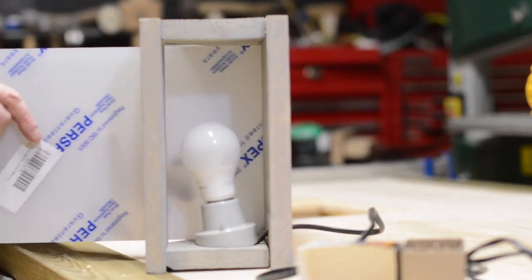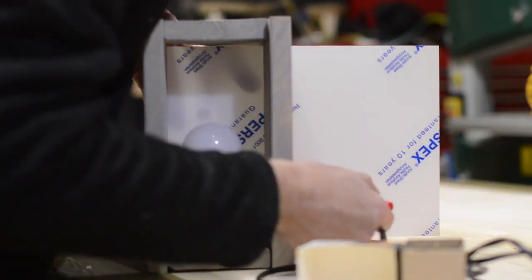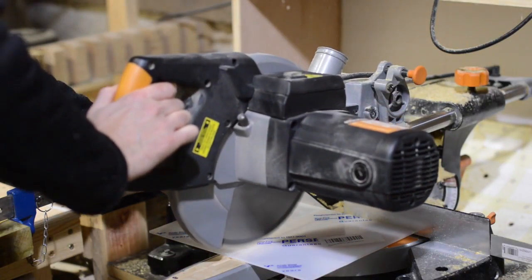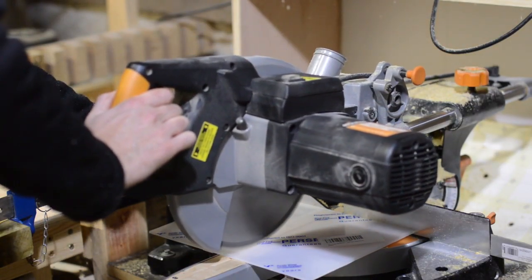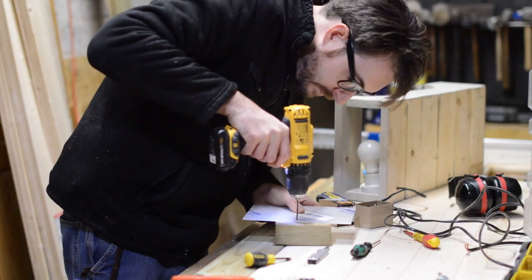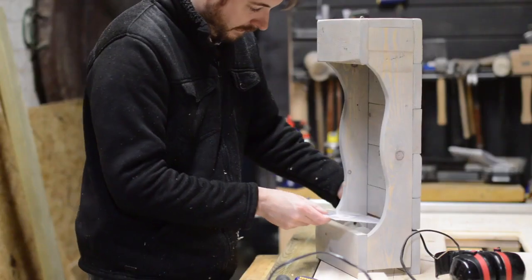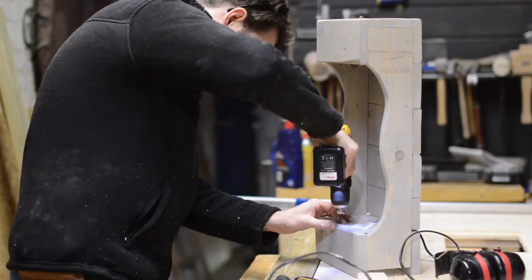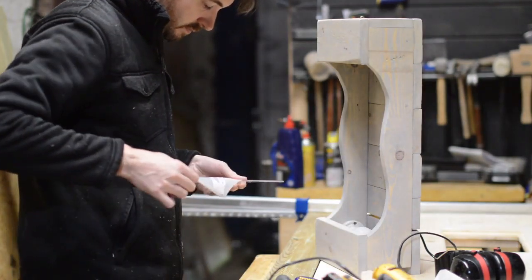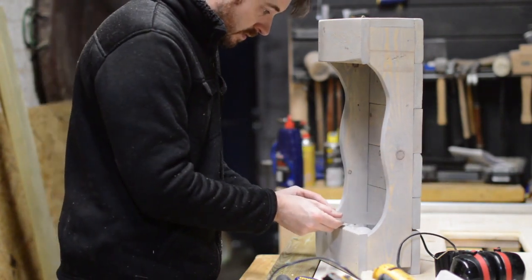With the electrics in place I can fit the frosted perspex. I slide it into place and then just mark where it needs to be cut. The good thing about this evolution saw is it cuts multiple materials without changing the blade — I could have cut it on the band saw but then I'd have to spend ages trying to change the blade just to make one cut. I carefully drilled through the perspex, put it in place and then drilled through those holes to make pilot holes in the wood. Then I could remove the plastic coating and hold it in place with some little brass screws.